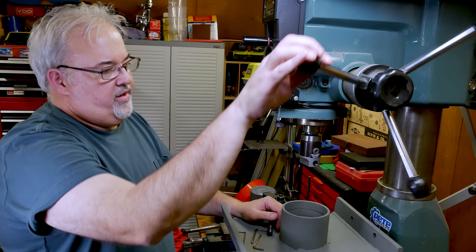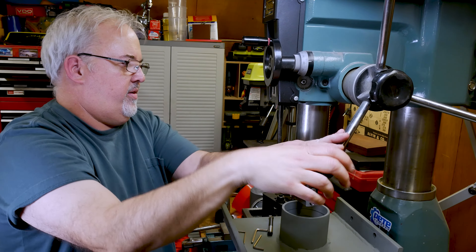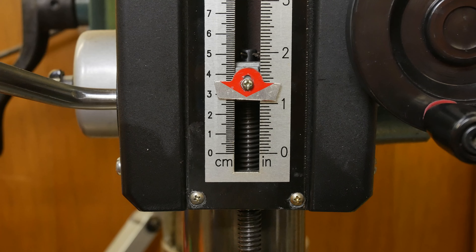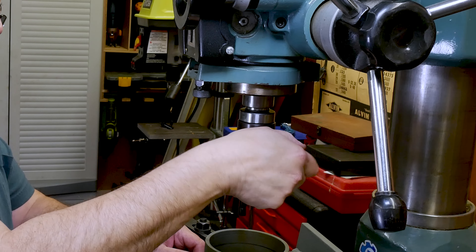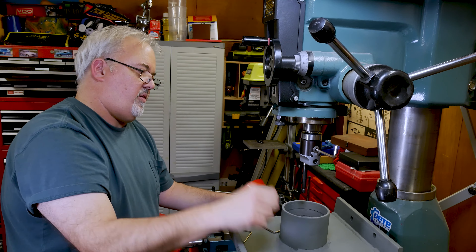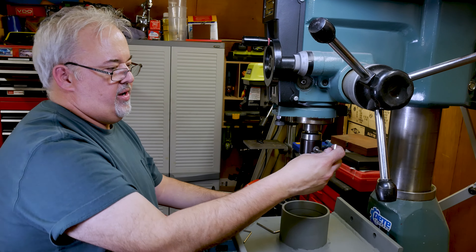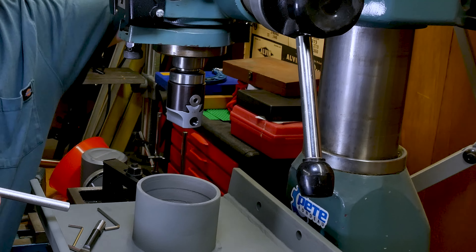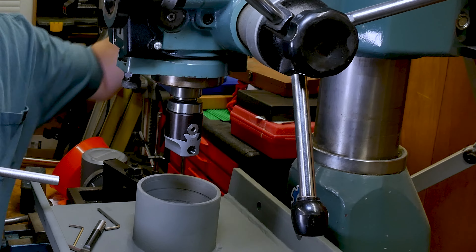I'm going to have to tear into this and investigate this someday, because for some reason this no longer goes all the way down. As far as the stop gauge is concerned, we've got another inch to go but we can't get to it, and I don't know why. This is going to be a problem - we can't move this without disturbing our setting. We really need to run this head horizontally, but then we don't have the depth we need. Alright, change of plans - we're going to lower this head and we're just going to have to eyeball the bore with the boring head.